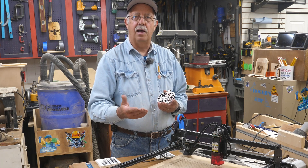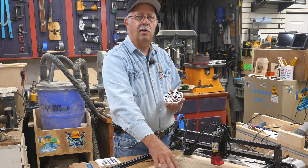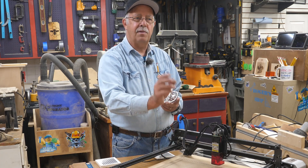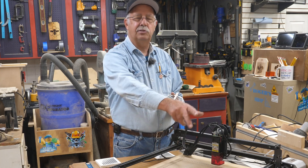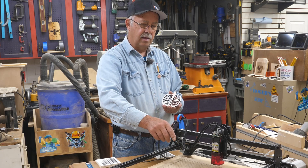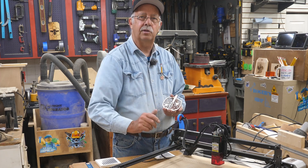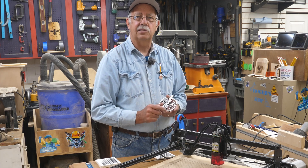If I set up my cut on my honeycomb board and put the file on that SD card, I can run it time after time after time. I can cut two of these pumpkins at once on a board. Because of the planks I get — long and narrow because they're cheap — I can cut two at a time. When it's done, lay the next plank down, hit start on the screen. I don't have to mess with the computer — the G-code is already set. So yes, that's a big plus.